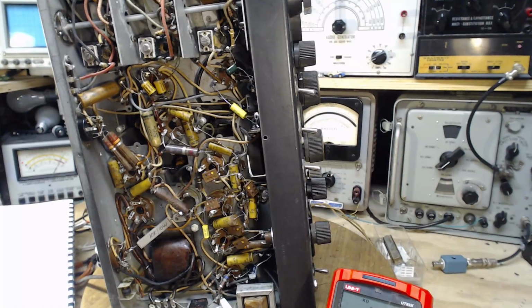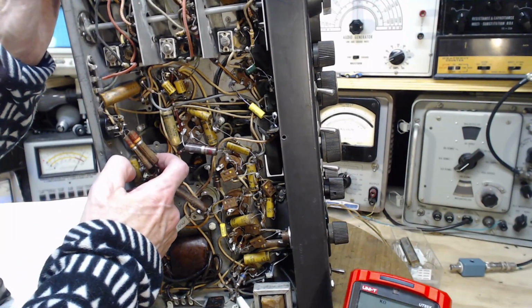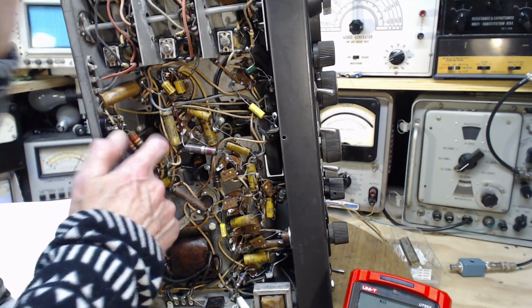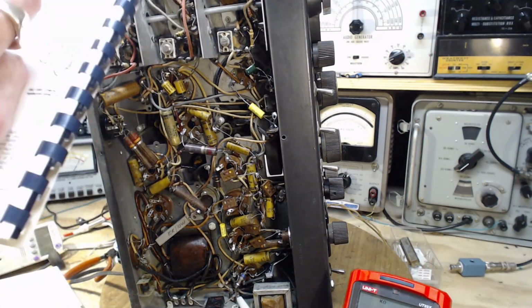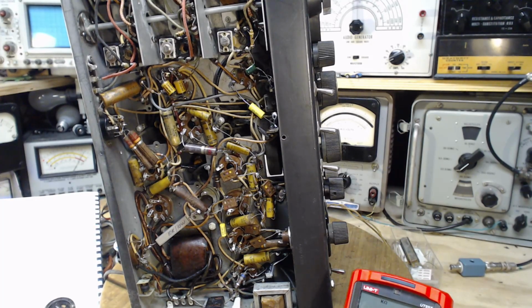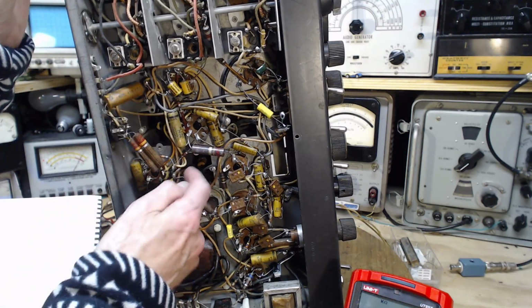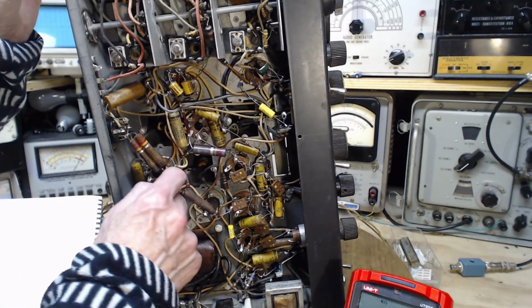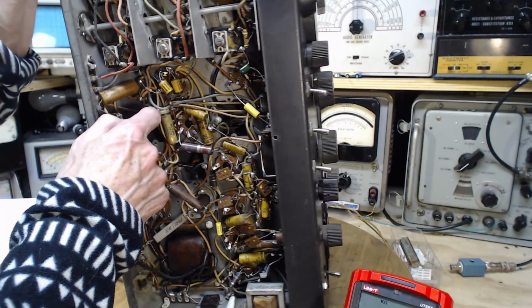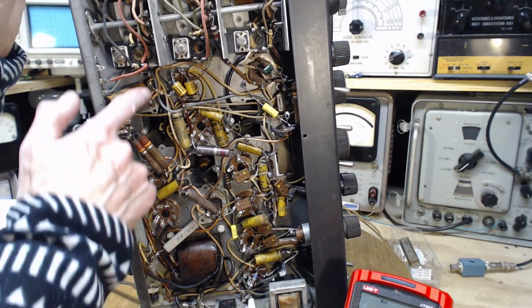So the fact that I get a reading of 1300, maybe that's the correct reading, because now if this is a brown, then it's 330. That's what this says. The chart says 330. By observation, how can that possibly be? There's a wire here going way up in there. There's another wire. No, there isn't. There's just this wire going up to parts unknown. Literally, it's going up. Looks like it's attaching to this resistor that I changed out.